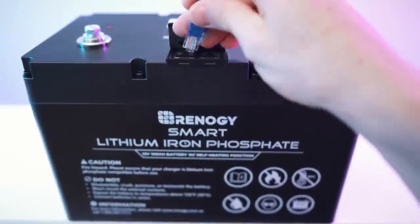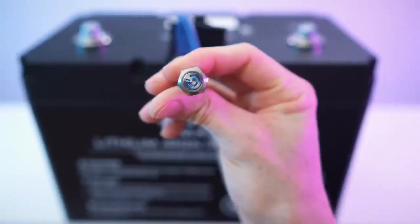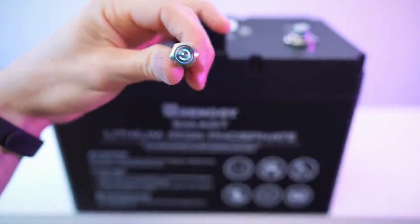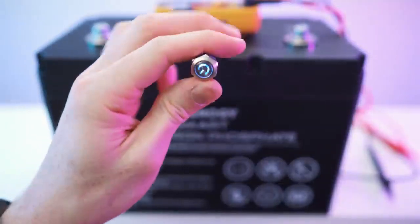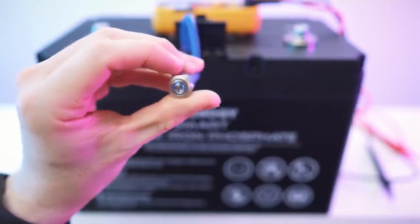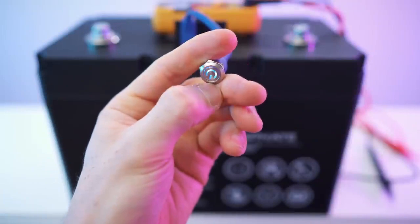And the battery is currently in the sleep mode, so to say. And with the on-off button, we can, it's actually active. Really? 2.9 volts. Oh, now, never mind, now it's on. That's way brighter now. So let's check the voltage again. 13.3. All right, so it's super bright, and now 1, 2, 3. And now it's deactivated again in the shelf mode. But of course, I want them to be active. There we have it.